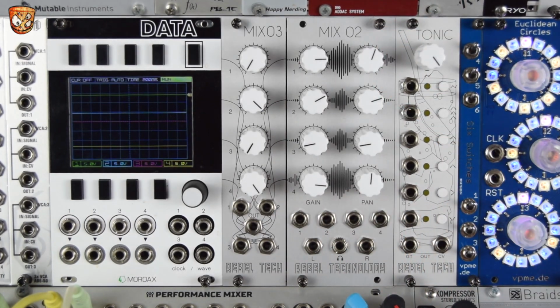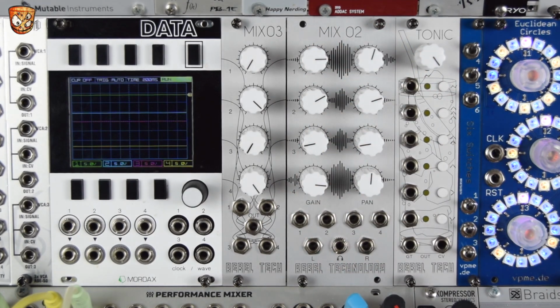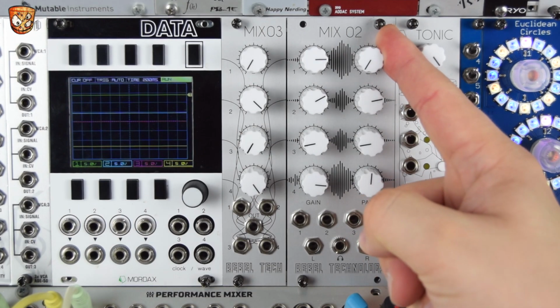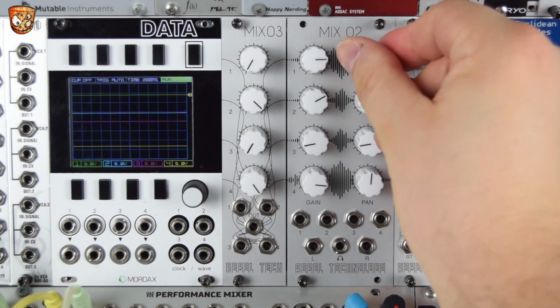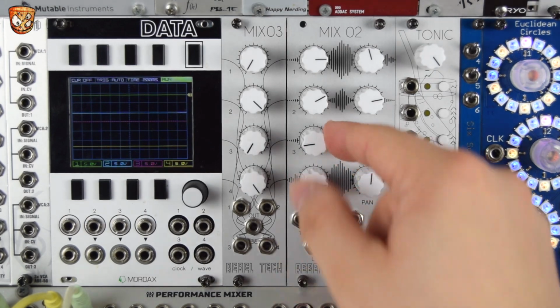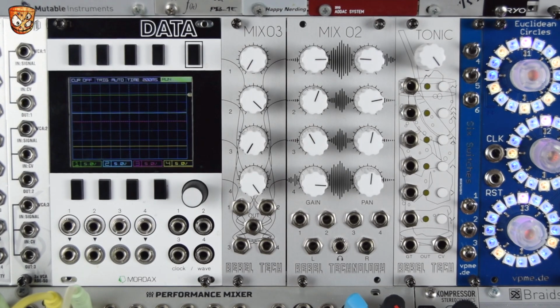Later on we'll use 2 patches where we can see the 4 inputs for audio and panning, as you'd expect, stereo audio, but also CV, where you can blend envelopes. Say we had an envelope on channel 1, just the left output, or just the right output, or any blend of both. It gives a crossfader style feel to your CV inputs, and you could mix sample and holds, LFOs, envelopes, and route them freely to the left and right outputs for more creative routing of your CV.